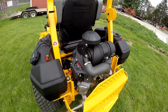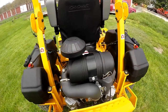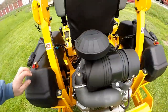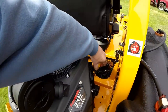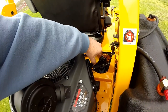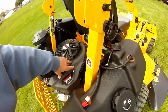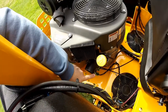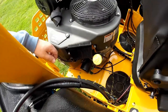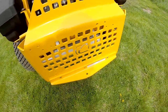At the back of the machine we'll take a look at the Kawasaki FX1000V 35 horsepower engine. Right on top of the engine you have your air cleaner — remove the tab, pull the cap off, and the cartridge out. Down along the left side you'll see your drain hose for your oil, with plenty of room to get in there and clean. You'll see your oil dipstick to check your oil — remove the dipstick, wipe off the oil, stick it back in, screw it down to check it, then pull it back out and read between the two lines for your oil level. Right below the dipstick you'll see the oil filter with plenty of room to place a pan for oil changes. Behind the engine you have a nice quarter-inch thick steel guard, and attached to the guard is a hitch to tow a trailer.